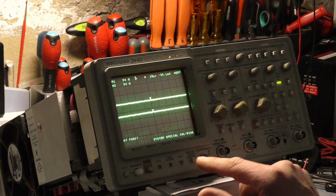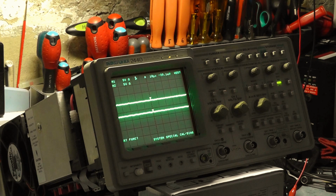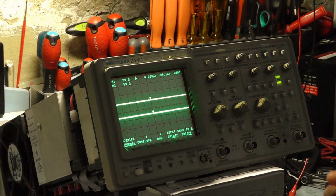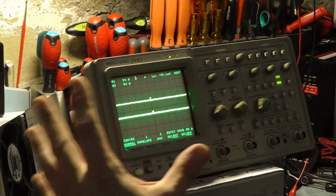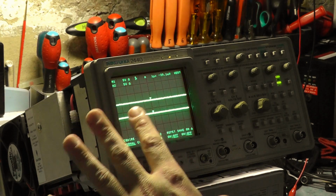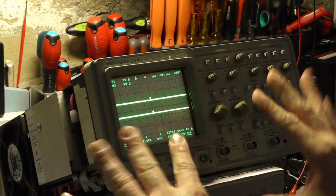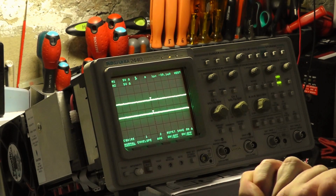But in the meantime, I'll show you something else, just to reiterate what you'd expect to see on a scope with good CCDs. If we go to acquire mode, we're acquiring at 200 microseconds with both channels up, and you can see that the waveform's nice. You've got no problem at all with shifting the levels up and down, as you see. Now that's running in real-time mode at the moment, but when it goes into its, I can't remember what term they use for it, it's the mode where, because you're sampling such high frequencies, it grabs the data from the front end of the source you're looking at and puts it into the CCD, in layman's terms, and then it builds up a picture of what the waveform looks like.